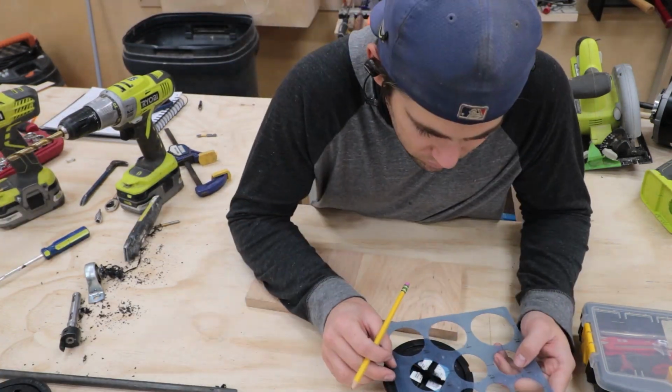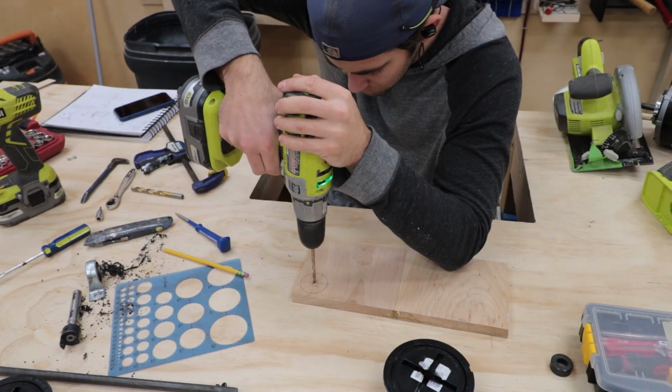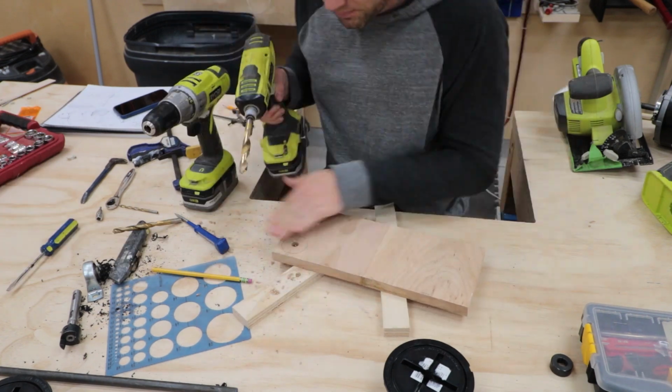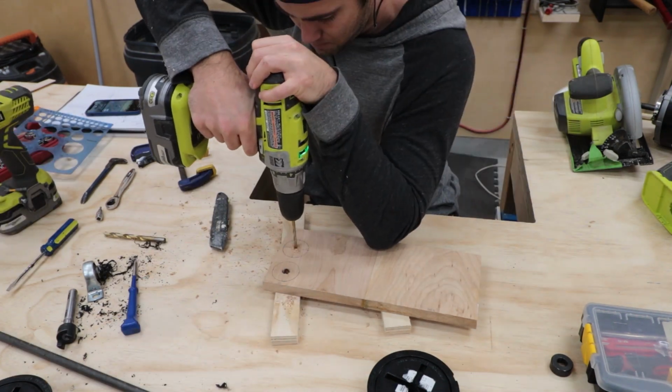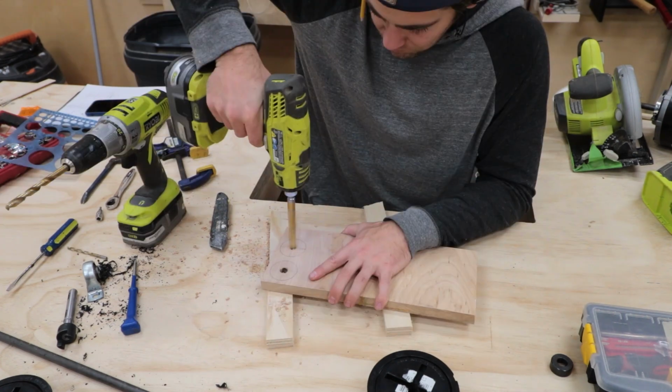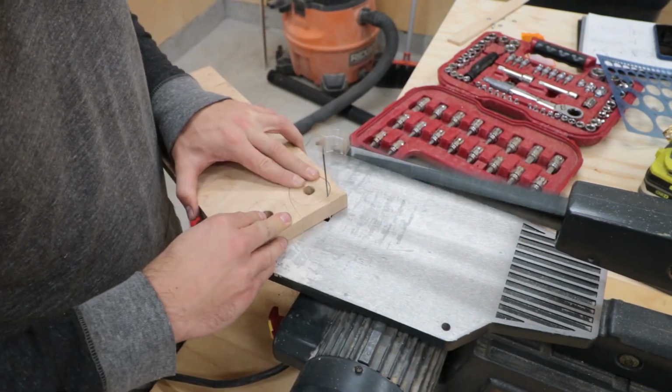I'm making the shaft collars out of birch wood. This is a leftover scrap from something I made, either my office desk or my living room mantel. It's a hardwood, so it's more durable and less likely to crack or split. I traced larger circles, then punched half-inch holes in the centers. Then I cut them out on my scroll saw.